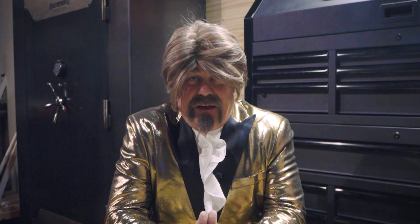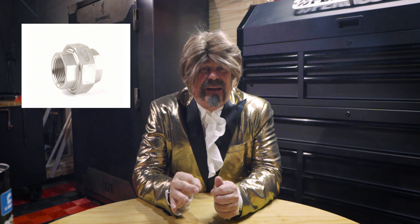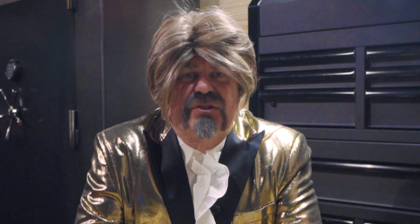Introduce yourselves and talk about your favorite joints. Hello there, I am Enrico Suave — Enrico Tight Threads Suave — and I'm all about threaded joints. These babies are super versatile and work well for both metal and plastic pipes. They're easy to install with no fancy tools needed, just a good old pipe wrench. However, they can be prone to leaks if not sealed properly. So remember to use Teflon tape and pipe dope to keep things watertight and make a good tight joint so it does not leak. That thing's got to be watertight.